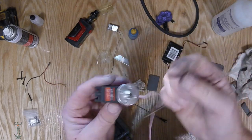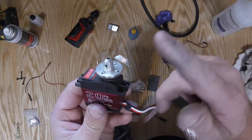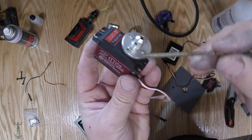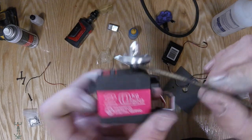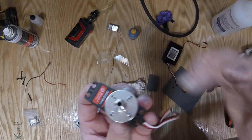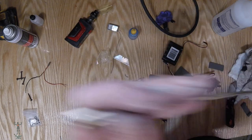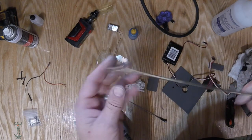This is a direct drive throttle cable from Zip Kits. If you guys at home have a gas boat, chances are really good you have a throttle linkage — a hard throttle linkage going to a pivot point on the engine bracket, and then a bell crank that transfers leverage. I hate them — I haven't used them in years. When I discovered these from Joe at Zip Kits, it changed everything. Direct drive. You can buy them in 12 or 18 inches — I always get the 18. If I need to put it in a long boat, I just cut it down. It comes with this horn, and then you put a servo wheel on your servo, screw the wheel centered, and that set screw locks into this cable. Then this goes directly to your carburetor butterfly rod, and that's it.